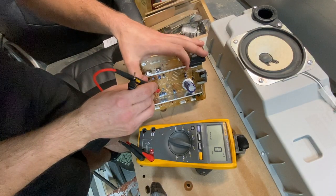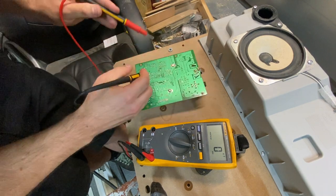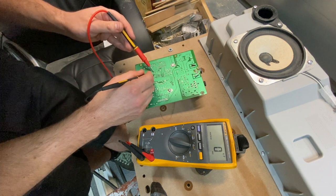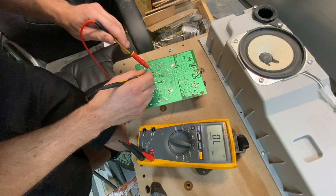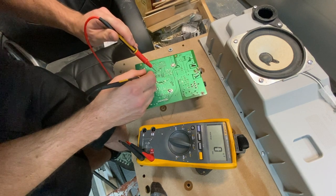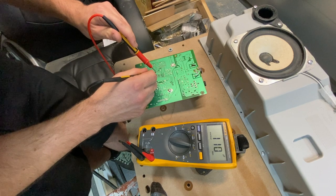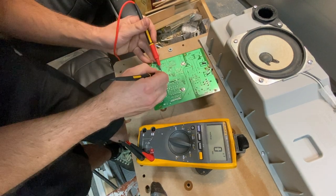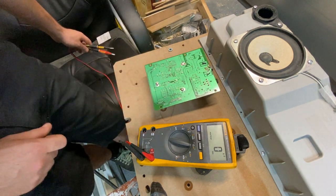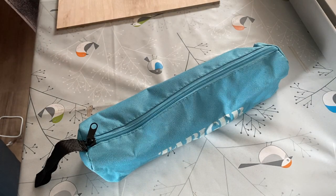Our readings won't be accurate because they'll be measuring the other capacitors in the same circuit, but it will give us an idea whether something is wrong. The capacitor has a black line down it — that's the negative side — so I want to find this on the back of the board. One, two, three, four — that one is C207. It's not picking up anything. What about C208? Let's try that one — 110 microfarads. So yeah, it's C207 by the looks of it, showing open circuit. I think if we replace that capacitor we should be in business.